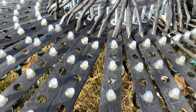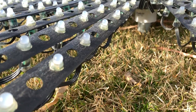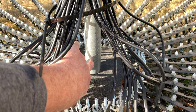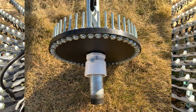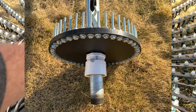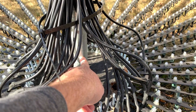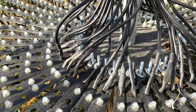Underneath here I have a piece of PVC pipe — maybe two or two-and-a-half inch — just a coupler connector, only a couple inches long. It slides over the outer conduit, and I have another hole drilled and tapped in the side horizontally for a small bolt, basically like a set screw that touches the side of the conduit. I slide that on when first setting up the tree, the HDPE piece rests on top, and I tighten the bolt down — that's how I hold the height of the bottom skirt.